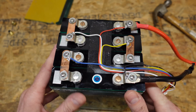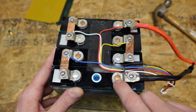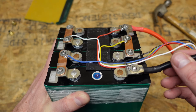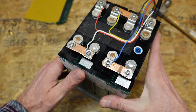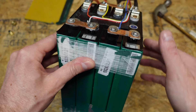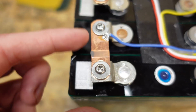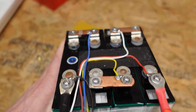The assembly is pretty unique. They have main posts coming off the battery with a center pin — it almost looks like a rivet, but there's no movement. On the main negative, there's simply a Phillips screw holding it in. On each of the adjoining connections, they have a piece of copper going across the two terminals, also held with Phillips screws, with the balance lead soldered directly to that copper piece. I've not seen anything like this in other batteries reviewed.